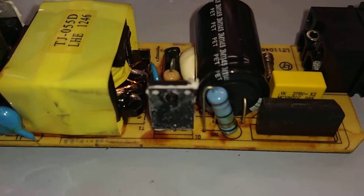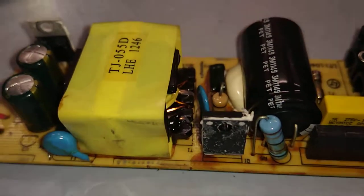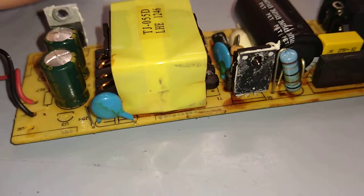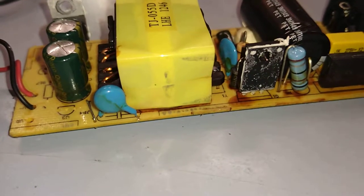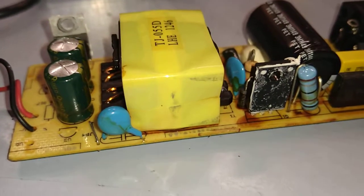Now, when I bought the R61, which is now upstairs in a spares box, the supplier sent me a power supply, which was a genuine Lenovo one, similar to this one here. But it had a nick on the power cable, so I asked him to send me another power supply, and he did. Very kindly, but it was this cheap generic one. Now, for months and months, when you turn the laptop on with this plugged into it, the laptop would be whining, like a very high-pitched coil whine in the kilohertz frequencies, the whining of the coils, which indicates they're not getting enough power, or there's some sort of ripple or undercurrent.